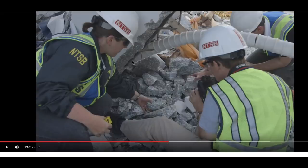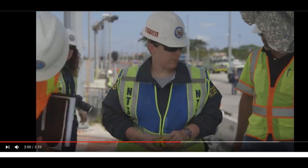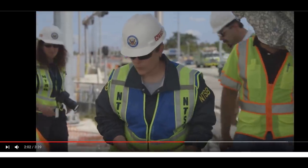This is my concern. Not getting carried away with that. This is my concern. This cable, this number one rebar. I have a video where I'm showing how I can break up a sidewalk using the knowledge of knowing where the rebar reinforcement is. Because of the void it creates, a nice, perfect void that I tap into. We're getting close now. So here's the rebar reinforcement over here where it was, this number one. I'm going to explain how I think that helped the failure.